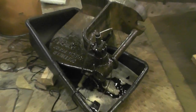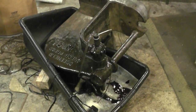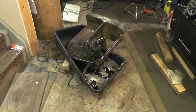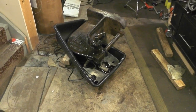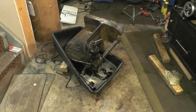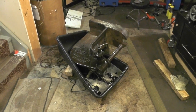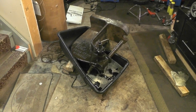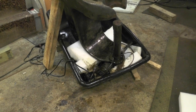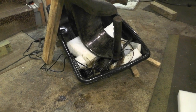The other day I tried to pull this gear off right here — applied some heat to it, tried tapping it off, it wouldn't move. Grabbed the gear puller, still wouldn't move. Applied more heat with the gear puller, still nothing. So I put it back into the Evapo-Rust shower. It's roughly 10 o'clock Sunday afternoon, the 28th. After letting it sit for about eight hours, I tried yanking that gear off again and nothing — tried heating it up and pulling it with the gear puller, still nothing.